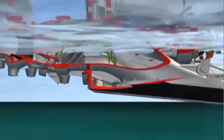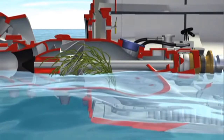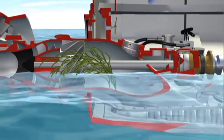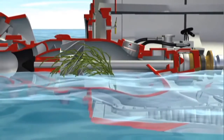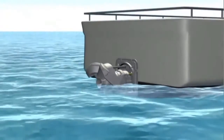If something is ingested into the Waterjet and wraps around the mainshaft or impeller, it can be cleared by disengaging the Waterjet before opening the inspection hatch cover and reaching in to remove the object by hand. Always ensure your inspection hatch is above the waterline before opening to prevent flooding.